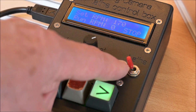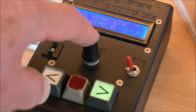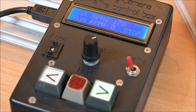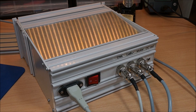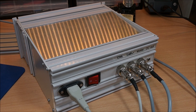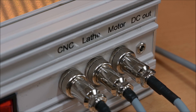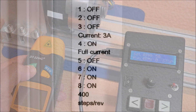It's a very simple design containing all the basic functions. I don't have any experience using a lathe, so I will toy with this one. The rotary encoder's push button is connected to the Arduino reset, acting as an emergency stop. I also designed a PSU box which contains the power supplies, a stepper driver called the DM542, and the necessary connections — one to the CNC, one to the lathe control box, and one to the motor. The DIP switch settings use full current and 400 steps per revolution.